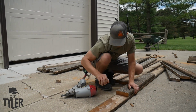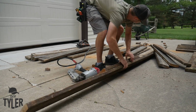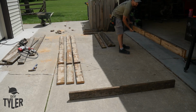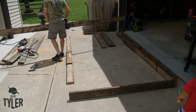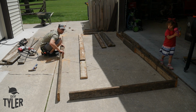Now, this is 12 foot long by 6 foot wide, and I didn't have any 12-foot boards, so I had to whip out the board stretcher, which was just nailing a couple planks together. I did use nails to pre-assemble everything, and then I will go through later and add 3.5-inch DeckMate screws to make sure nothing pulls apart as we are moving this chicken tractor around the property.